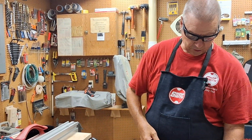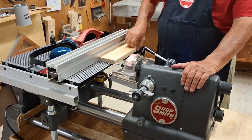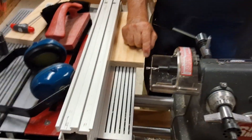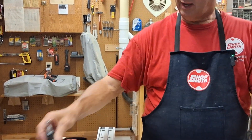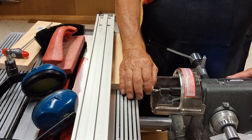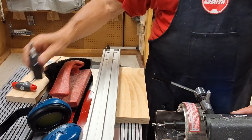So let's get on with doing our sliding dovetail. We're going to cut the female joint first, and in doing that we're going to route out the majority of the center of that dovetail with the quarter inch straight bit — that's the purpose of having that in there. You notice I have two router chucks. I've got a half inch router chuck, which all of you had when you did the assignment, and I also have the quarter inch chuck with the quarter inch shank, quarter inch router bit. So I can just swap out my router chucks.